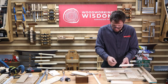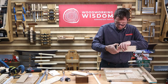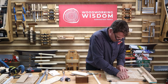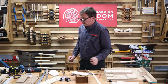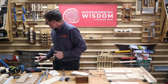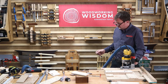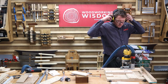We could go with where we are, Japanese file. Which way do I need to go if I take it off? Tiny bit off the depth, really. So I bring it over so I could put them back in. And this is almost ironic, having got the nice practice one done, just that little bit tight. So we don't need the 4.9, we want our 5. We want to go back to the router. Can bring that over. I want to go fractionally deeper, and I mean it's minute. So I've just done the fine adjuster, a small little minute turn.